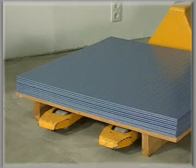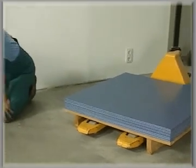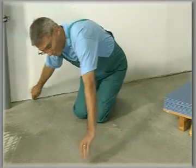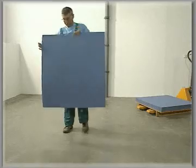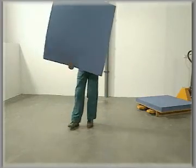After you have checked the Norament floorings for color and batch uniformity and allowed them to acclimatize, divide the room up by marking it with a string line. Dry lay the tiles. Lay the tiles out over the entire surface. Note the direction of the arrows printed on the back of the tiles.